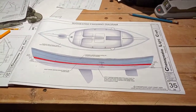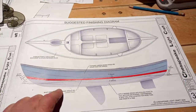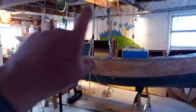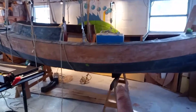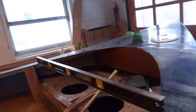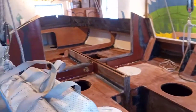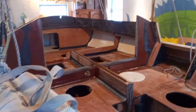Today is Monday January 10th and I'm working on a few different things. The boat is up in the air — I've used the same pulley system as before to raise it, then put sawhorses underneath with foam padding. I've leveled the boat both crosswise and lengthwise on top of the centerboard, which is flat, and the deck should be in the same plane as the waterline.